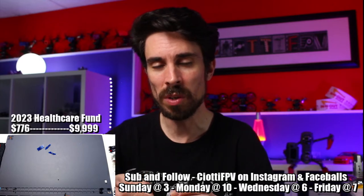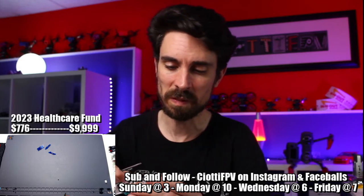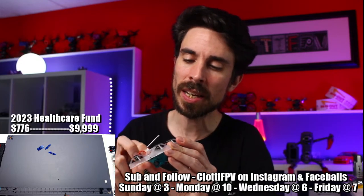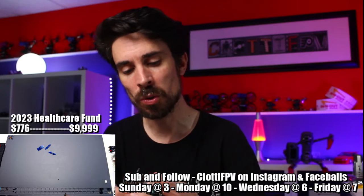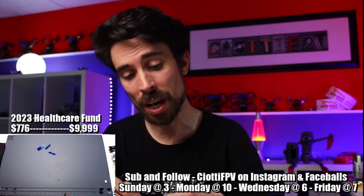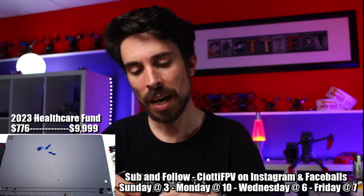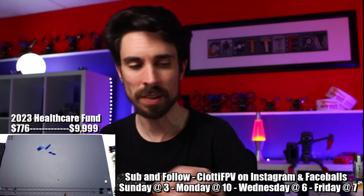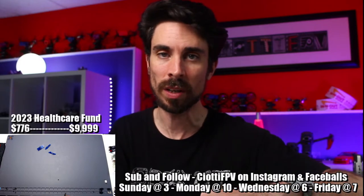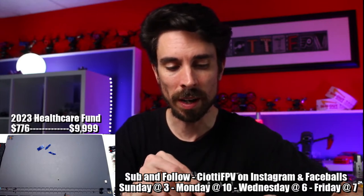Tiny Whoops are unique little beasts. They just tune differently, and this rig is a little bit heavier than what I'm used to with the Mobulas. I believe it has a BMI 270 gyro, which is 3K instead of 4, and it has a different sort of noise profile to it. So to be super honest, I kind of just trust them, and I'm impressed enough with their tune that I don't want to go totally off script here and put a more normal tune on it.